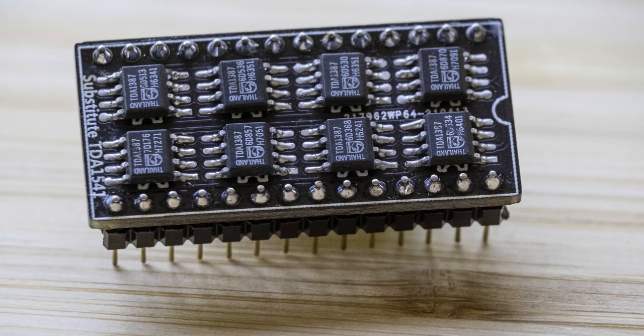Then I realized he's actually not selling anything. He's giving you all the information and just trying to get the word out about it. This DAC is called the Proto DAC and it's based on the vintage Philips 1387 chip, eight of them in parallel. This kind of design doesn't need a lot of components — very few parts, really simple — and it only needs one 5-volt power supply.